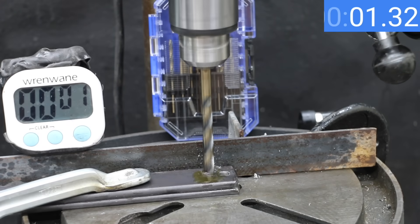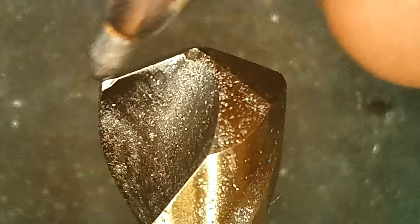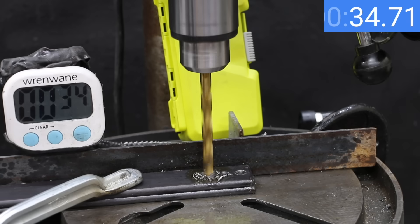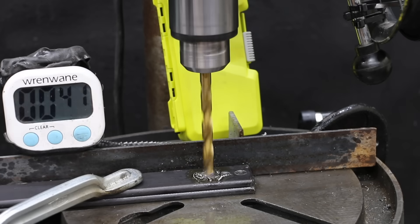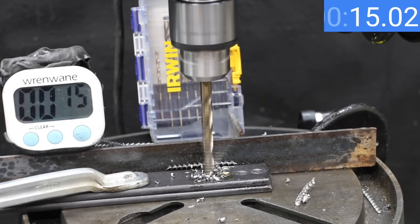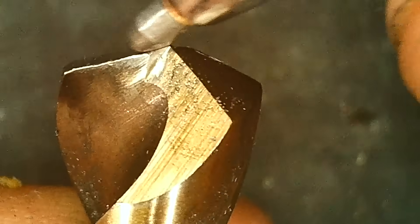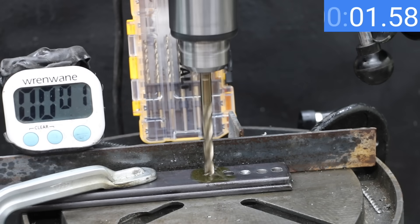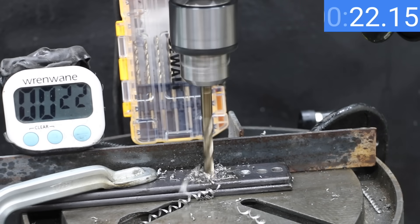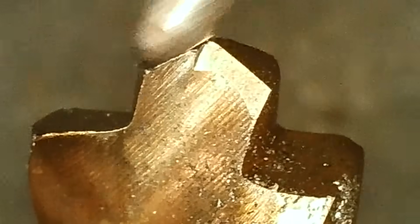The Somata was one of the slowest drilling bits in the last test and is still slow this time at 36.16 seconds, though it experienced a lot less damage than the DeWalt. The Ryobi really struggled at 50 seconds drilling through spring steel the first time, and is just too soft and dull to drill through a second time. The Irwin was faster than average on the previous test and is faster again this time at 20.55 seconds, with the bit still in pretty good shape despite some wear. The DeWalt Cobalt was faster than the Irwin last time, but this time is slightly slower at 23.19 seconds, though it still has a lot of life left.